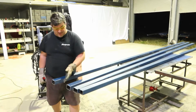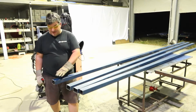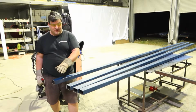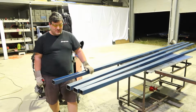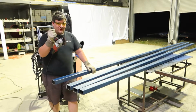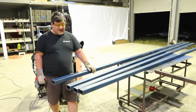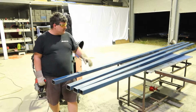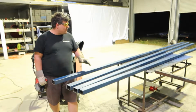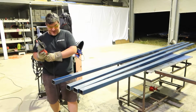We've got to make four, like 10 degree cuts. I think they're roughly somewhere between 10 and 11. At 14 mil squared, 14 mil made in a triangle is about what we want. Because that will not cut accurate and this is fairly critical, I'm going to do it with the grinder by hand. But it is what it is. We'll get these cut, and we'll cut each end, then clean each end after that. That'll be good. Alright, I'm going to delete half that, but let's do it.